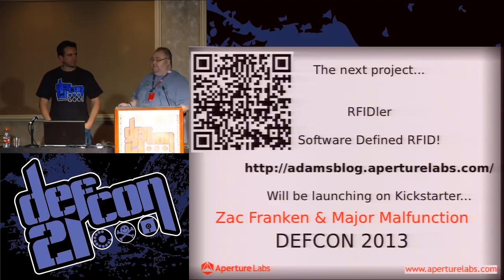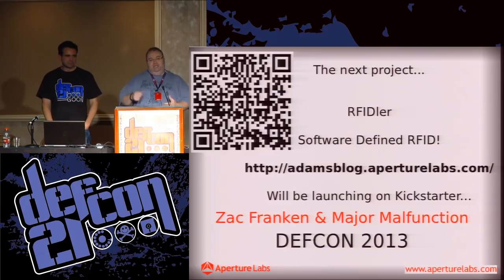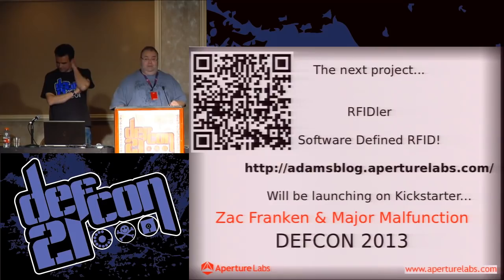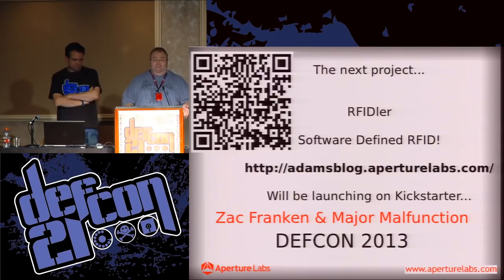We do a lot of embedded systems reverse engineering, and normally a lot of the security is crap. They're taking the crown jewels, the super secret master keys, and storing them in chips that aren't really designed to secure keys and things like that. We looked at an RFID vendor and their latest and greatest product, and they'd stored their keys in a PIC chip. We sent it off to a slightly dodgy company, and they said, oh, that will be $900, sir. And they sent us back an entire dump of the code, including all their super secret keys. We've had chips reversed that have cost as little as $90. So if you have a cheap PIC chip, $90 will get you the code.